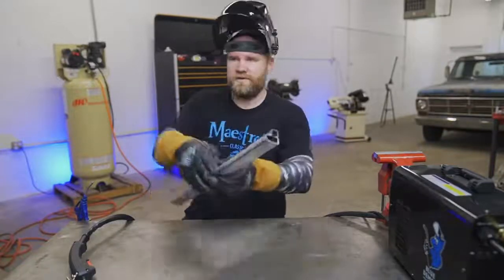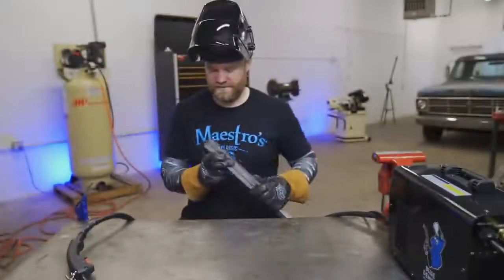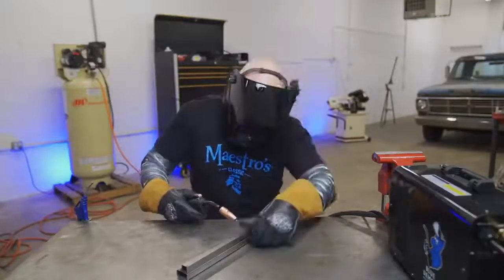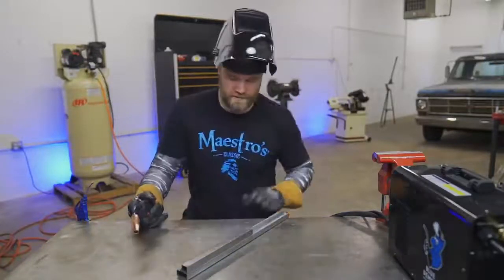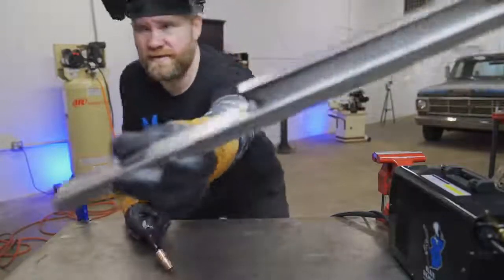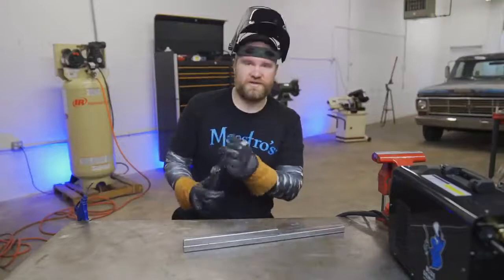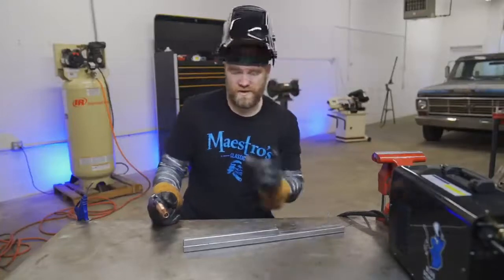I think that's what it was. Got a big goobery tack on there — it's not pretty, but I kept stacking the weld until I got all that porosity out of it. Now I'll tack the other side; hopefully this one will be clean from the start. Much cleaner — I'm still getting this little nipple coming off of it. But it looks like the gas problem is solved. It sounds good, we got that nice crisp bacon sound. I think I'm going to leave the settings right where they are and try to run a little bead.